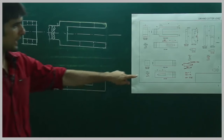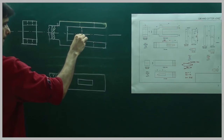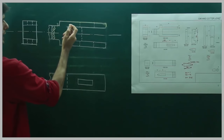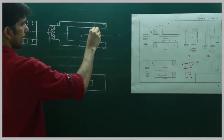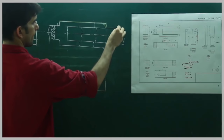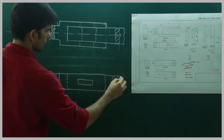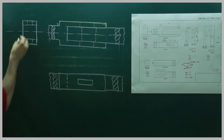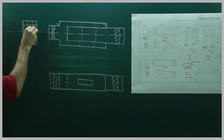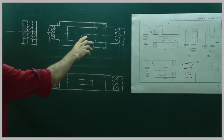Now we will insert the eye end. The length here is 30, and on the other side it is 27, so automatically there will be a 3 mm gap — it comes on its own. Taking 30 from here you draw a line, and this dimension is 35, so you draw a line and extend it. Inside the view there will be a dotted line from top to bottom. We do hatching because of the shaft — this is a square shaft, and this joint is generally used for square or rectangular shafts.